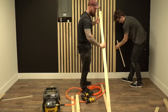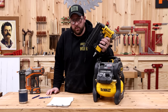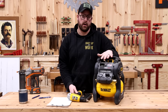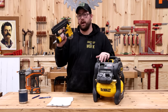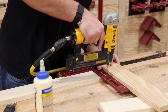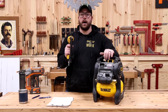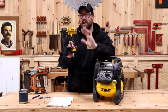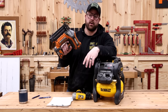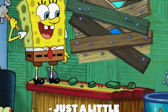For $219 you can get into a cordless compressor, which opens up a lot more. One of these 18-gauge brad nailers from Porter-Cable only costs about $90, so you'd be all in at $310 — just $60 more — and you can shoot 18-gauge nails, or purchase a 23-gauge pin nailer for $100 to $200, or step up to 16 or 15 gauge. You can use the compressor as flexibly as just having a cordless nailer, and from a gun-to-gun standpoint you get a much more favorable tip and better penetration. This tool is so much lighter and nicer to use than the battery-powered ones, which are heavy and have a huge nose on them.